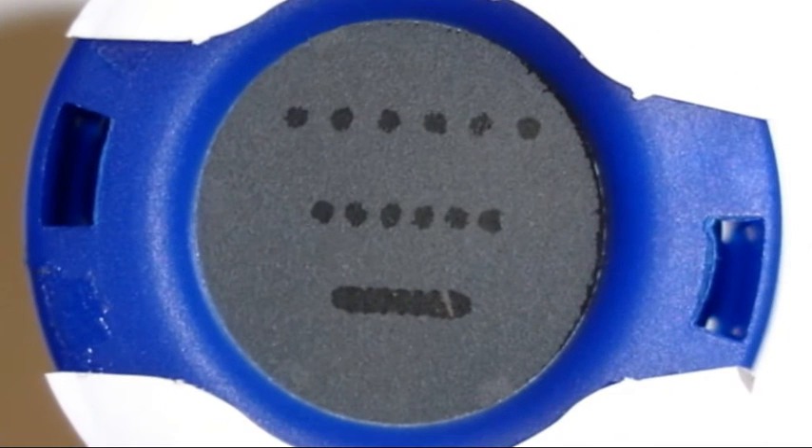The following pictures are examples of tests where oil has been present. The first picture shows dots present on each of the three rows, but none of the three rows have joined into a continuous line, so the oil concentration is greater than 0.05 but less than 0.1 mg per cubic metre — a pass to BS EN 12021. On the second picture, the bottom row of dots has formed a continuous line, but the middle and top rows are still individual dots. Therefore, the concentration is greater than 0.1 but less than 0.5 mg per cubic metre — still a pass, but only just, to BS EN 12021.